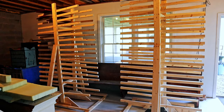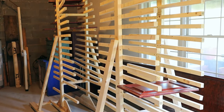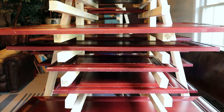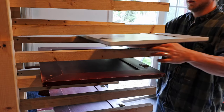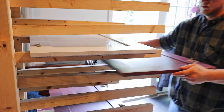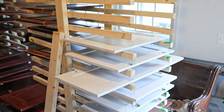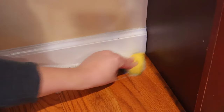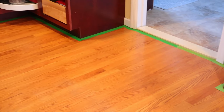We built these drying racks when we painted another large kitchen and needed somewhere to put the doors and drawers during the whole project. Building something like this is not necessary, but it can really help you confine and organize all of your cabinet doors. We'll link two YouTube videos by other creators in the description that show you how to make them. Whether you choose to spray or hand paint your kitchen cabinets, these racks come in handy throughout your project. While cleaning all of your cabinet boxes in your kitchen, give special attention to cleaning the floor right along the edges of your cabinets. This will ensure that the painter's tape you will put down in the next step will stick well and not curl up later, especially when painting.